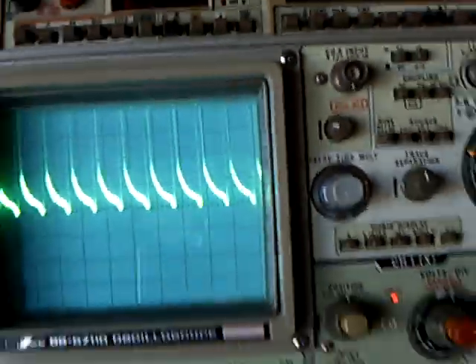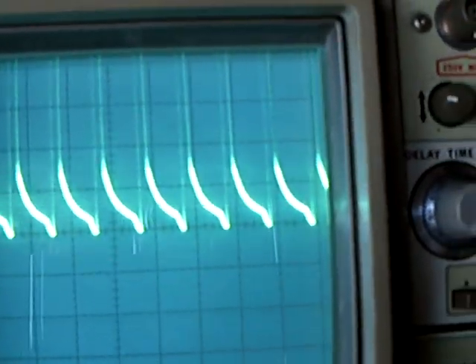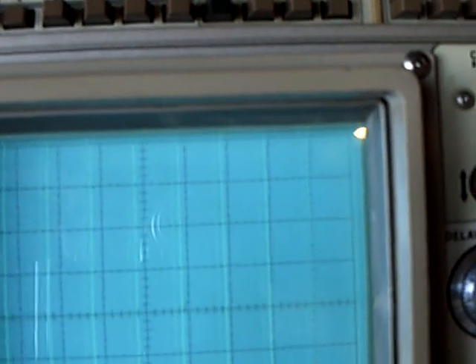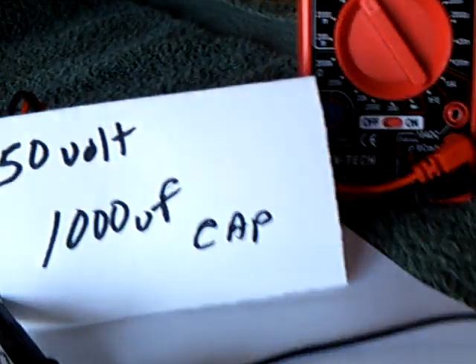There's my amp reading at three milliamps right now. There's the waveform — looks like a Bedini to me, standard H-wave. If you move this down, these spikes are just off-scale. These are the back EMF spikes that you get on this kind of a circuit.